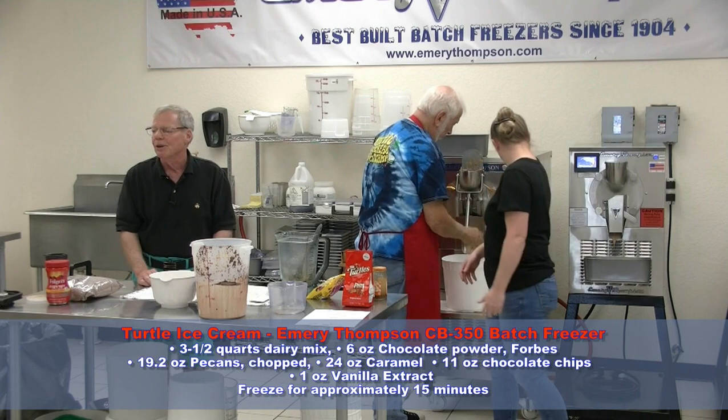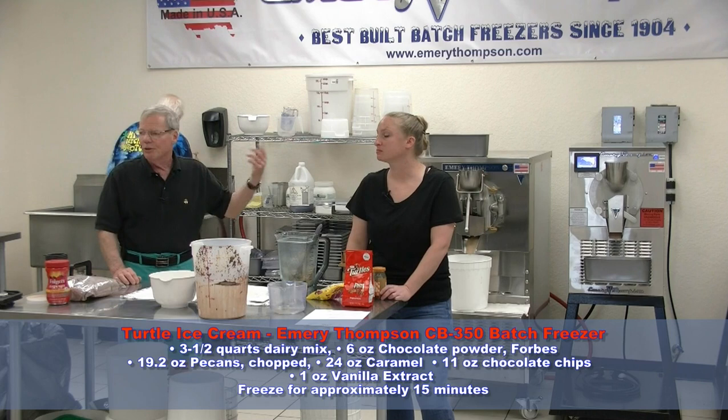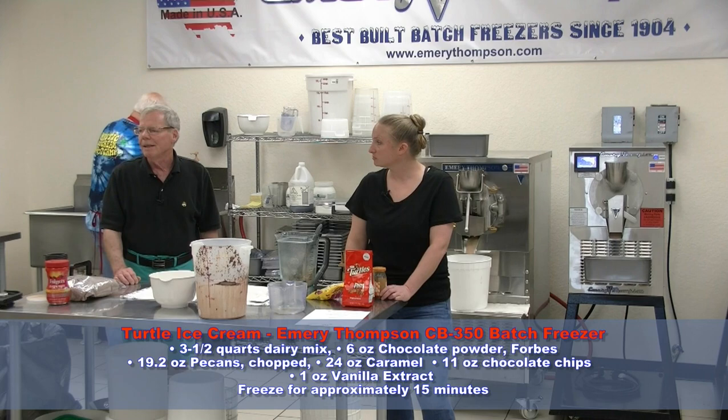If it shuts down, the machine will clean it out and reset. The machine shut down because you let it go too long. It's that simple. It's reading the torque, and it's going to read it to the point where it just says, that's it, we're cutting off. The amperage is too much. Does it come up on the display? It'll display a code, and it says reset and then ready.